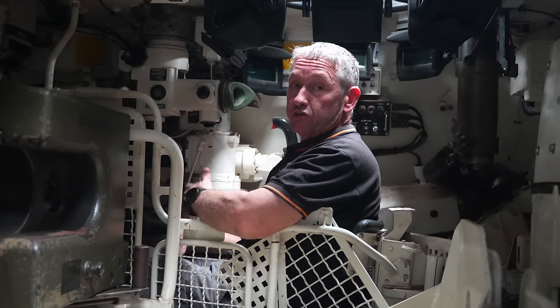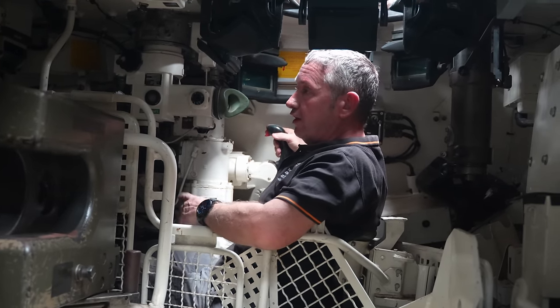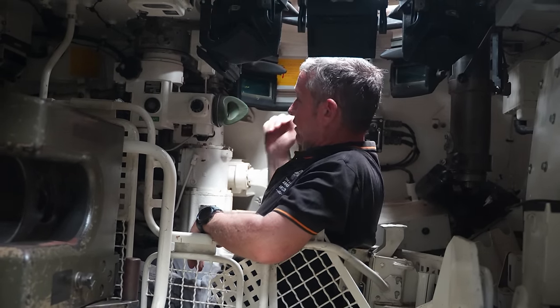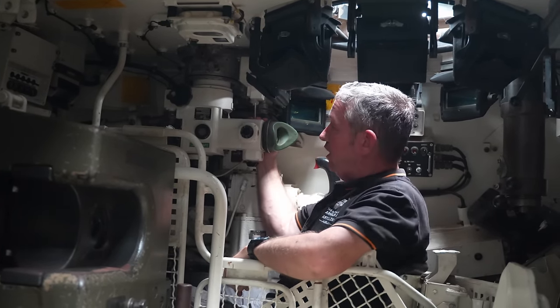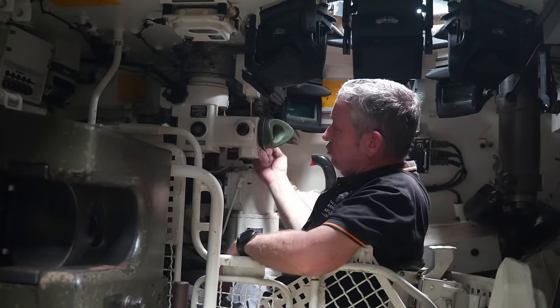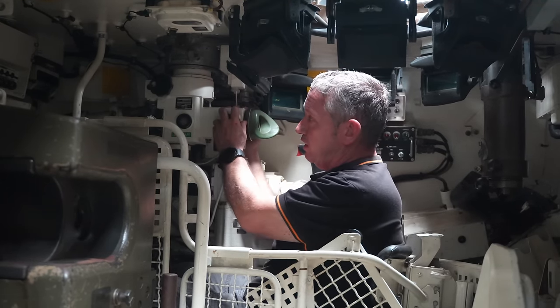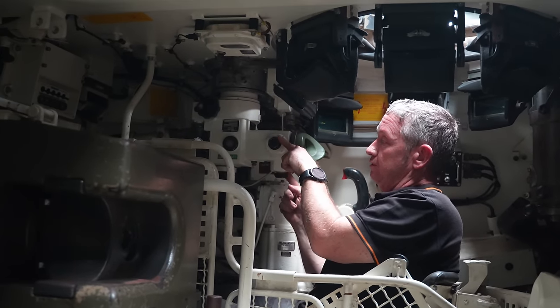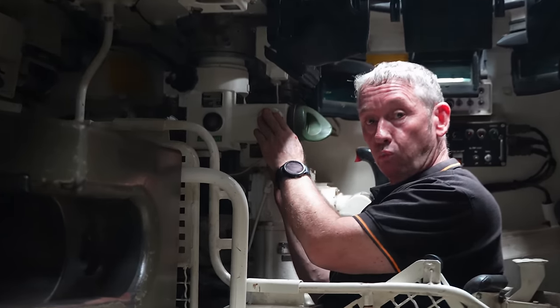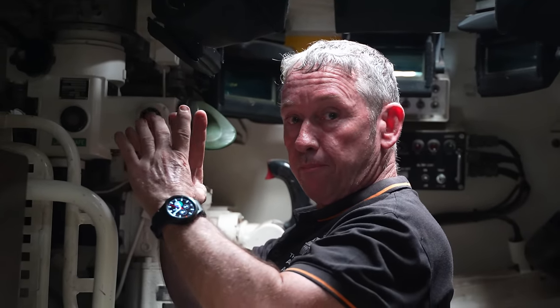I'm in the commander's position — this is where I spent a couple of years as Bravo crew commander. I've got the commander's control so I can override the gunner or point the turret where I want him to look or identify a target. My main sight is the TRP-2A — a panoramic sight, so I can look 360 degrees all the way around, with x4 to x20 magnification. It also has a stadimetric rangefinder — two knobs with measurements in metres. If I know the width and height of a vehicle, I put that in, and within the sight there's a perforated box. Once I put that box around the target I can read off the range and either shoot off my sight or give a range to the gunner.